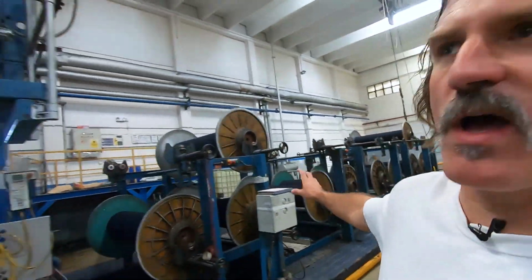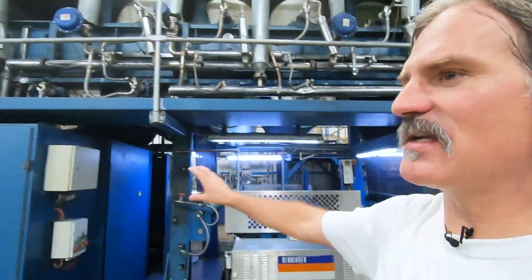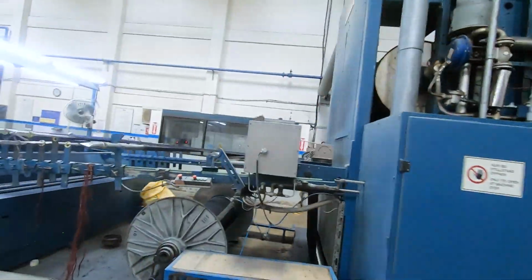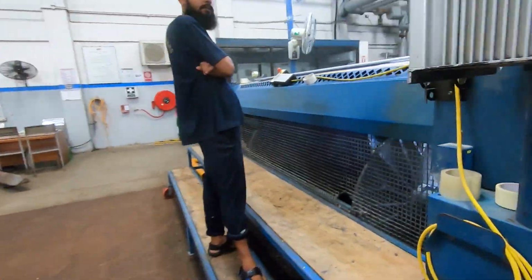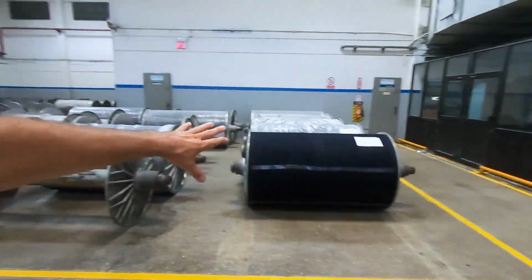Anywhere from 10 to 12 beams go through this process and get put onto a larger beam, which you'll see here. Now these larger beams go right over to the weaving room, it's a wide loom, it's an air jet loom. These things crank out about, I think it's 490 meters every 24 hours. So whatever that breaks down to, is that 20 yards, 20 meters an hour, something like that.